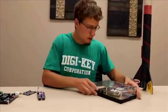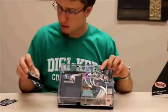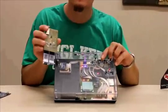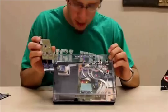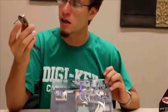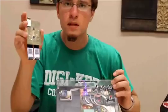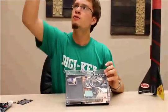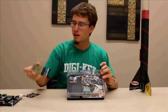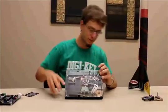Now, we are ready to launch. So we hit the launch button, and hopefully an LED will go on here. Hit the launch, and we got a little blink there. Now, right now, this guy is pulling data, keeping it all onto a data flash right there, right next to the LED. And so we launch the rocket, it goes up, it's moving around, jostling around, it has a little pressure on there so we know altitude, it flies, and the rocket lands.